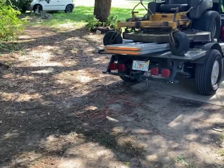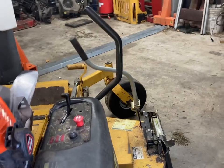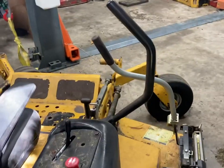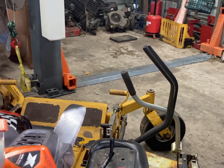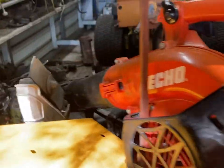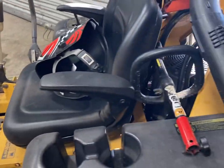The 60 is good to go right now and I could use it, but there are some local guys that like their lawn mowed really short, and I'd rather put this 72 on it — because this deck's already compromised, and when I cut the lawn short there's too much chance of ruining your deck by catching something with the rear baffle. I prefer not to mow short, but that's just the way it is. Alright, I'm going to get some material and get this welded up.